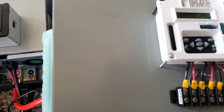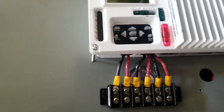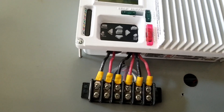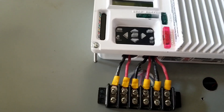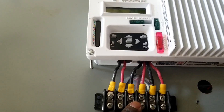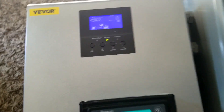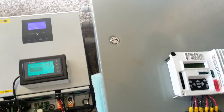So you can control things — when the batteries get low, it has a low battery shutoff you can control. Instead of going DC to DC, you can drain this battery almost to next to nothing, because at 12 volts on a 24-volt charging system it will just draw the batteries — it doesn't have a limit, you have to have a limit to cut off. So I'm not sure yet if I'm going to incorporate this VEVOR into this guy — I'm just using it as a charging device right now.